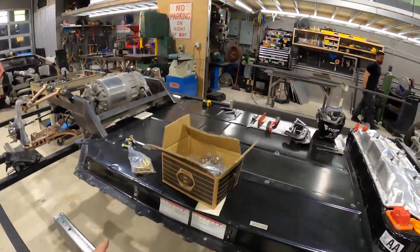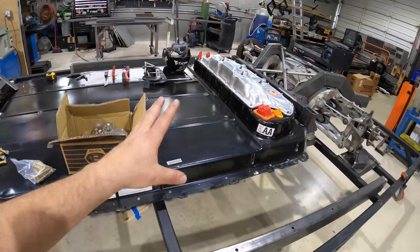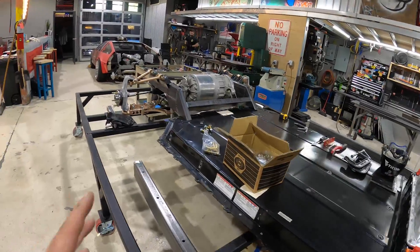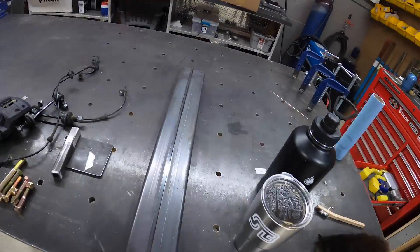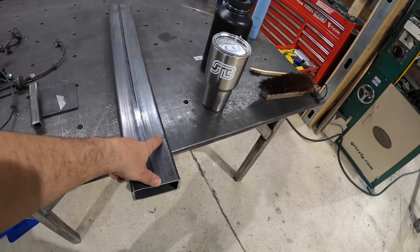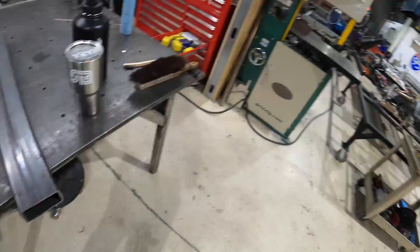Me and Donnie have been working on the frame rails. The Model 3 battery pack is bolted all down the side, rear, and front, so we're duplicating that same setup — just how Tesla would do it if they were building a 1986 Chevy C10. We're connecting our rear subframe and front subframe to make a complete and uniform electric chassis. This front mounting plate is two by four quarter-wall tubing. I'm drilling six holes and welding threaded plugs inside so we can bolt the front of the battery into the front subframe without through-bolting, keeping maintenance simple.